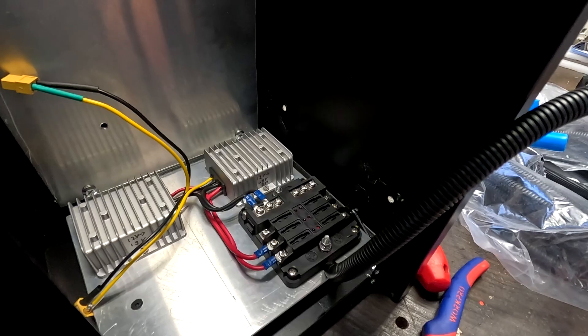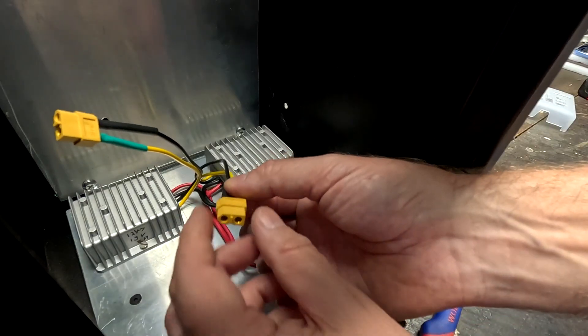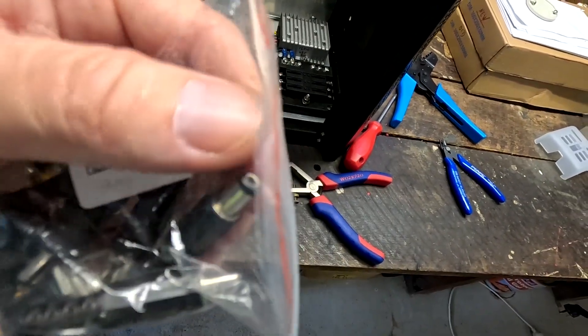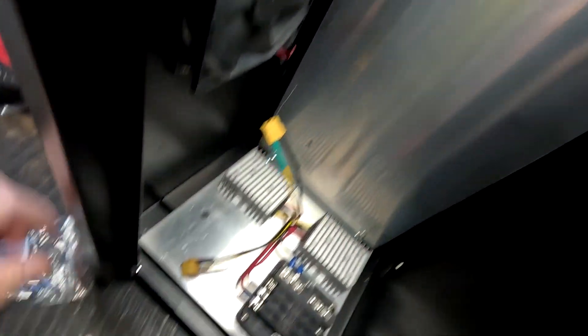I have to mention it again for all the new subscribers: in my infinite wisdom I already soldered XT60 connectors on the boost converters, thinking it was a good idea to have a connection between the boost converter and the actual device. But honestly it doesn't make sense, because all these devices — the POE switch, the network router, and the NUC computer — already have plugs on the back using these standard round connectors. I'll unsolder the XT60 connectors again, extend the cables directly to where each device is mounted, and solder on one of these round connectors so it plugs straight into the device. Why have another connection in between? Ctrl+Z — undo everything and start again.